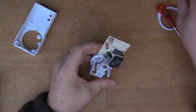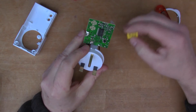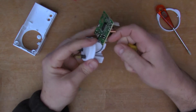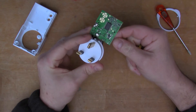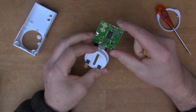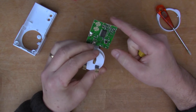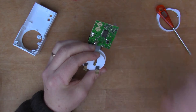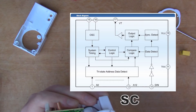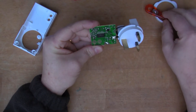It's a pretty simple circuit. Over here in the top corner we've got a capacitive dropper — there's a diode, this big capacitor, and I think this is a fusible resistor to limit inrush current. So this is the power supply section, which is very simple. Then there's a radio section up here with the RF components — a couple of little inductor coils — and the main chip is a standard multiplexing chip, the SC5272, which you can easily look up on the internet.